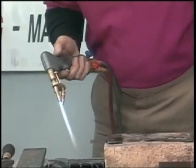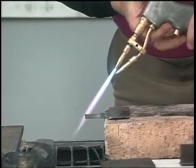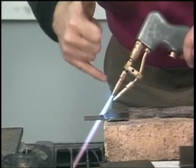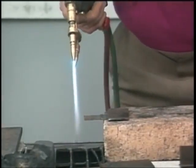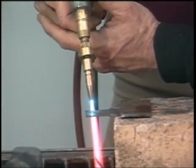All right, so when we get ready to cut, also looking at the metal, the book will show you, as you start to cut on your metal, roughly, and that's not critical, approximate, keep that oxygen tip, which is on the bottom, roughly about a 45 degree angle to the metal right there. That's not critical. You can still lift it this way, but that's actually where you get your best cut. All right, so always try and get two hands and try and get comfortable if you can.